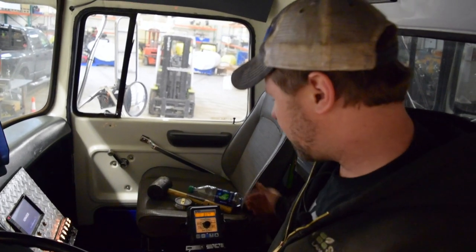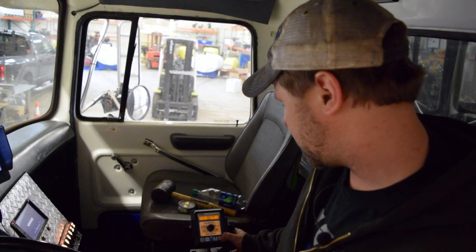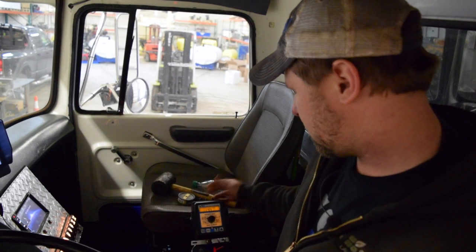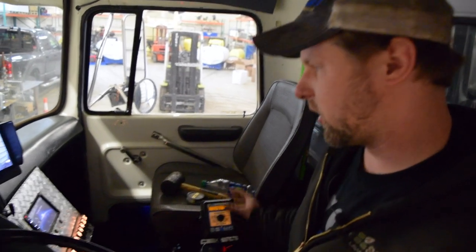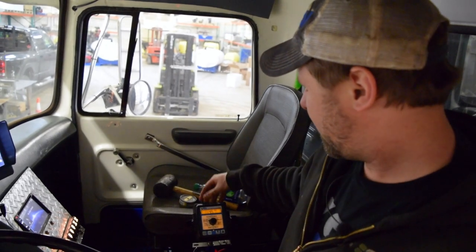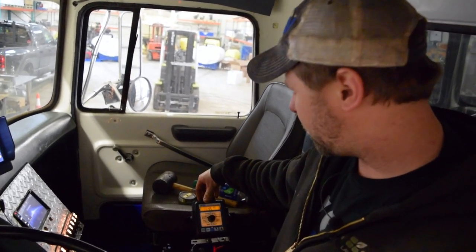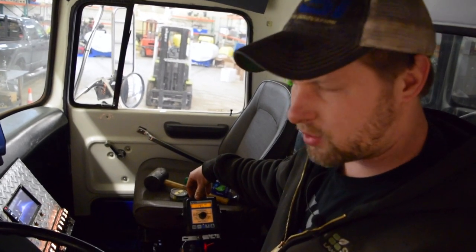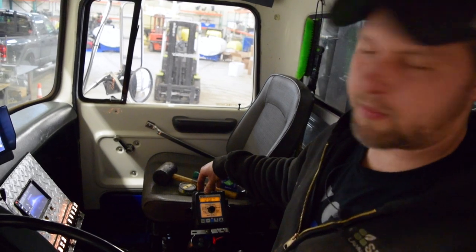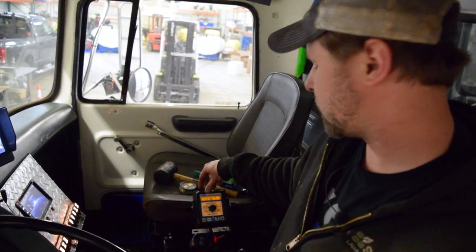On this one, we're going to engage our PTO, and now we'll turn our boom sections on. And you can see opening up the servo, 14 gallons per minute, right at the center boom. I'm not going to turn my side booms on because I'm actually in the shop right now. But you can pump it out this way if you want. To speed things up, we're actually just going to pump out through the 2-inch line here on the truck itself, just because we're inside.